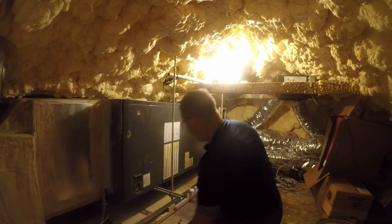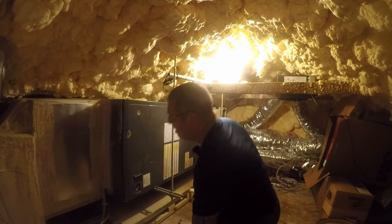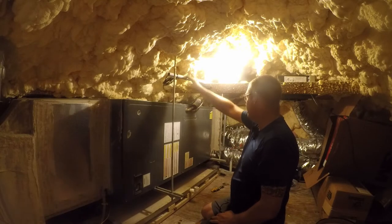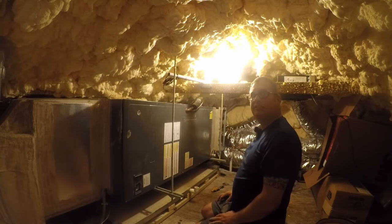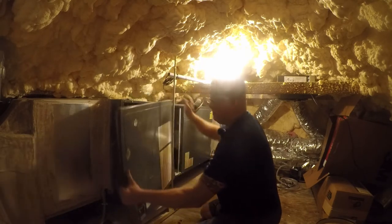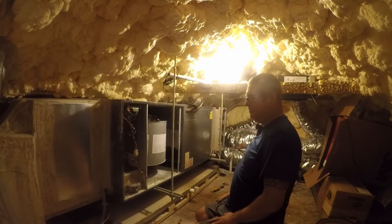You know, there are only a couple things I regret about this system and its install. One of the things I really regret is I didn't run conduit for the electrical for both units. That was stupid. Another thing that I really regret is I didn't run conduit to the thermostat. And I did end up running this, but I should have run that in the wall. That was just stupid for me to think this unit would last forever. But when you put a house together, that's kind of the space you operate from. You don't think your work is going to wear out, but it does.